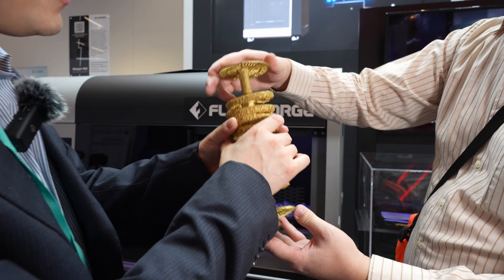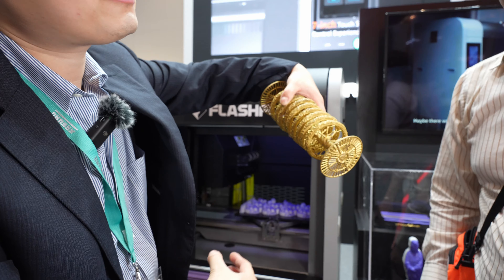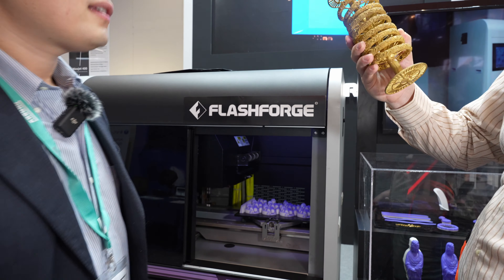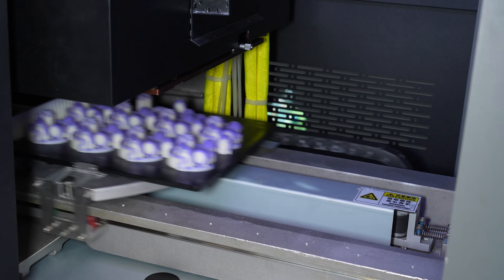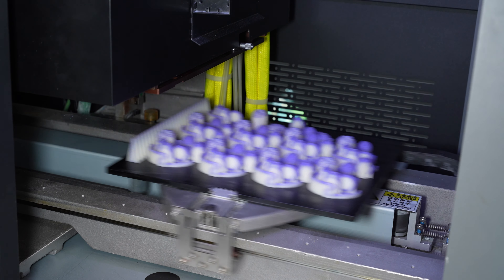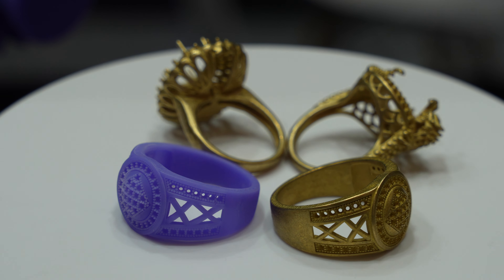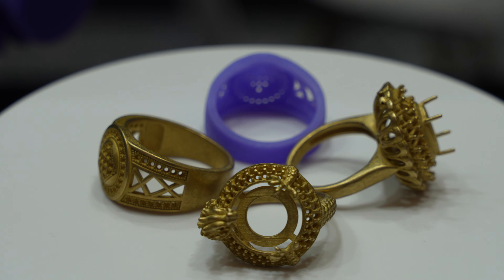You can notice that these parts are hollow inside. This kind of design is very difficult to do manually, but now it's normal for every kind of jewelry. And when you're making something out of gold, you don't want to be paying for all that gold inside if you can remove it. This machine is a revolutionary design because it has three print heads — normally wax jetting systems only have one and need to print three times. With our three-head design, we get three times higher efficiency in production.